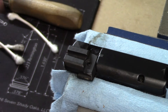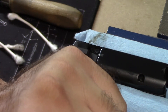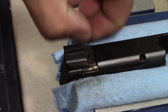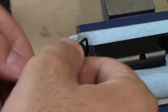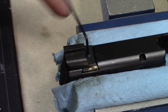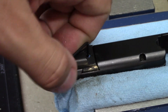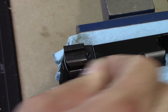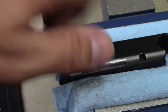You can see how easy it is going in right now — it's really not that bad. They seem to be fitted quite well, which is good because I did not feel like filing this if I didn't have to. So that is just about perfect. I'm going to go ahead and take this set screw out, put a little bit of Loctite on there, and screw it down — get it nice and tight, just hand tight, nothing more. Next time you clean this, give it a good scrub with oil and you can remove a little more of that brass and it will look good as new.